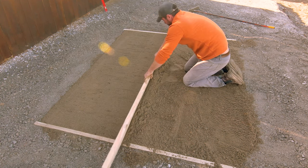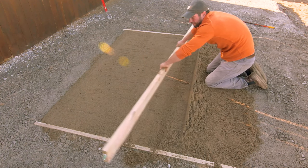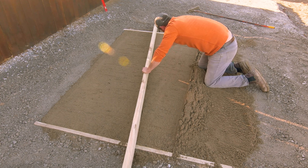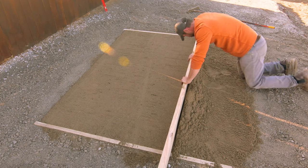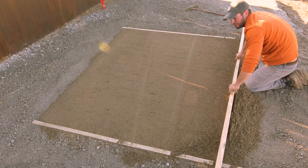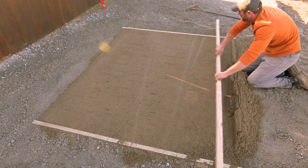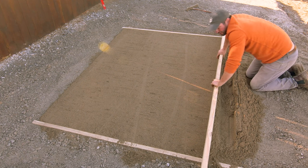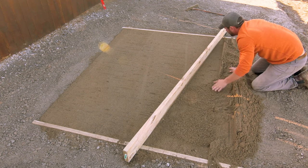Now that the sand is prepared, be sure and pull the screed board along the rails giving good downward pressure. It's very important to keep debris off the rails as you're pulling. If you get caught with a big buildup of sand, you can take multiple swipes to get the top off — that way that last pull is nice and easy to make everything smooth. Since this is what we're going to be building on top of, we really want to be meticulous to make sure this is perfect.